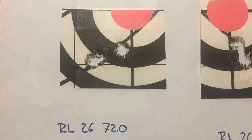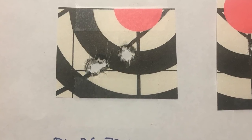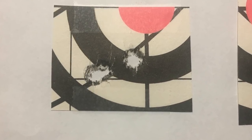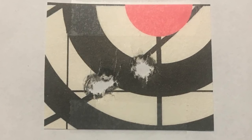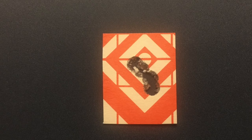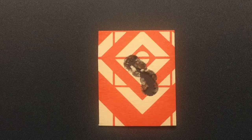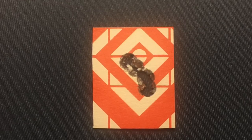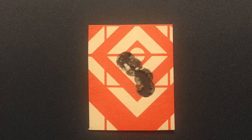When I began hand loading I threw some 215 Bergers in ADG brass, seated about 20 thou off the lands, and tried H1000 and Reloader 26. H1000 was shooting right around a minute; Reloader 26 with that jump was shooting closer to half a minute. Since I had some extra Reloader 26 on the shelf, that's what I ran through most of my field testing. I took that load out to 1,250 yards, shot in some really tough conditions, and was still able to make a couple of impacts on a 12-inch plate. I spent most of my time with this rifle at 600 yards and in, and it just hammered.